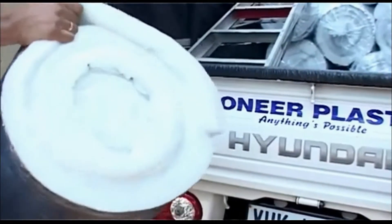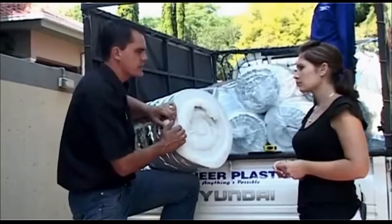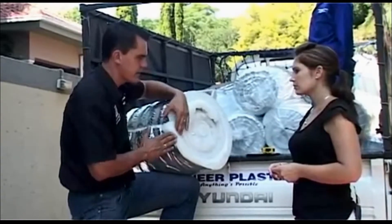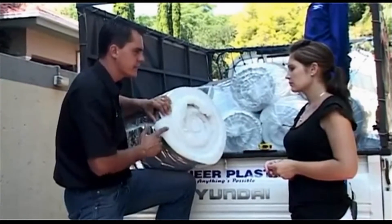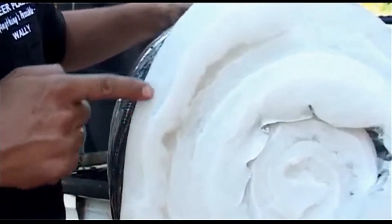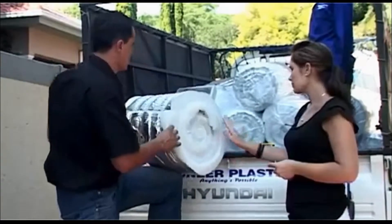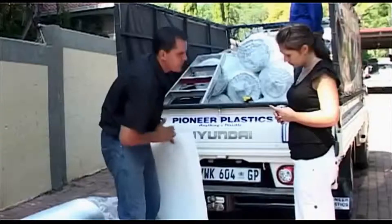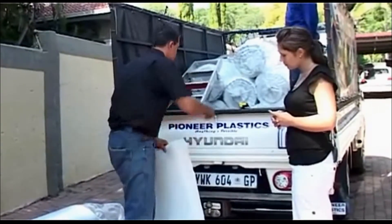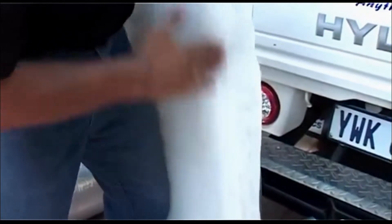During the process of producing the product, when we pre-slit, the edges of the material are cut with a crush cutting blade. At 8 bars it crushes the material and the edges fuse together. So when we check the thickness of the product, we're just gently going to rub on the edges to let the material open up — otherwise it's going to seem very thin. You can see the fusion line; we're gently rubbing that to open up the material and confirm it is the right thickness. Because of compression in the roll, within 24 hours this material will relax and open up completely.